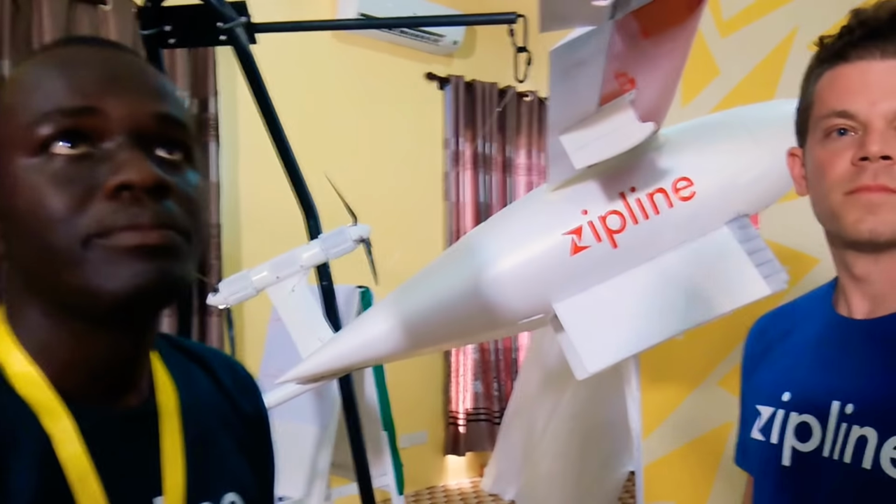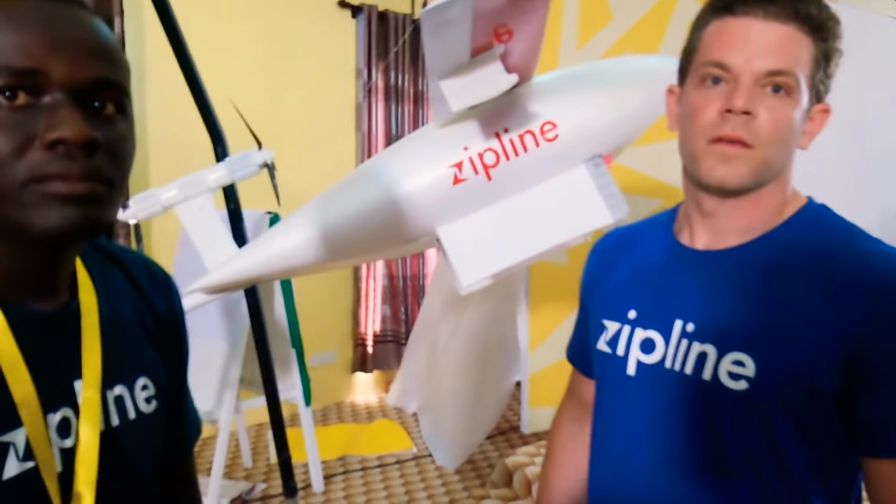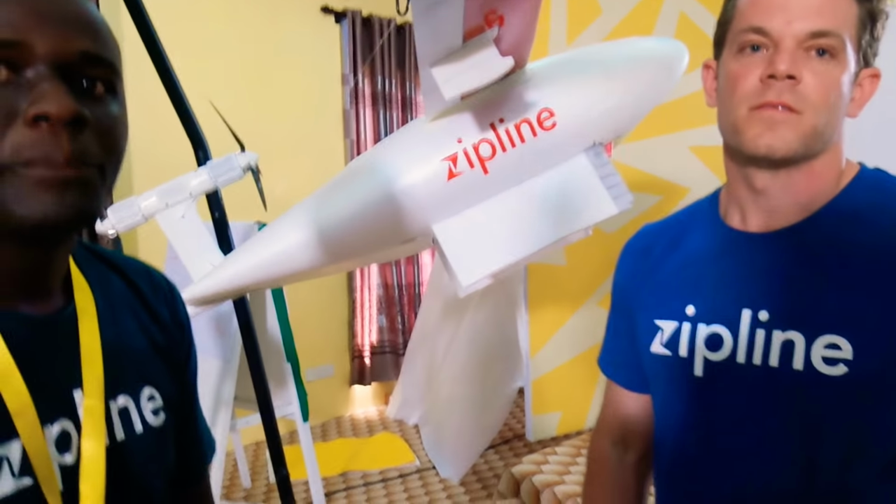But when you swap parts out, that would mean the whole aircraft hasn't been the whole aircraft the whole time. It might have been the right wing of one and the other one. How do you track then? This wing's done X hours, the tail's done Y hours. How do you track all that sort of thing? So definitely we have software which is integrated and which tells us this wing has flown this number of flights, this battery has flown this number of flights, and when we feel this is the maximum amount of time that it has to fly before servicing, we get that detail from it.